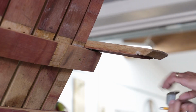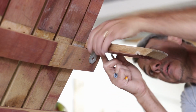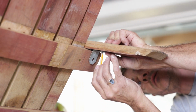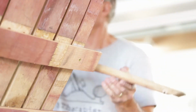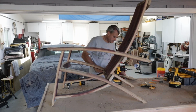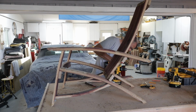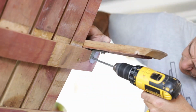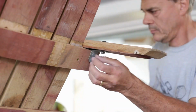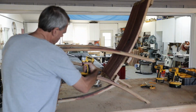The installation of the right armrest is slightly different than the left one in that we never drilled a hole of 29 7/8 inches in this stave like we did on the left armrest. The reason for this is that we can now mark the position of this hole using the bracket, and any twist that might exist in the chair can be taken up by the position of that hole. At this point, all the other nuts in the chair can be tightened.